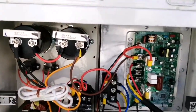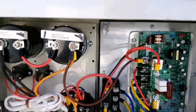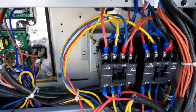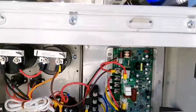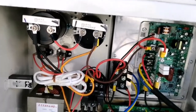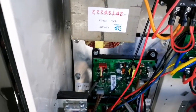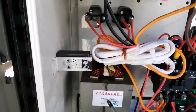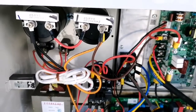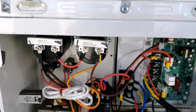On the back side you can see this is the IPM board for the inverter compressor. As I told you there are two fixed compressors, and for those we have two magnetic contactors — one on the right and one on the left. Here we also have one inverter compressor, and to run it there is an IPM board. You can see this is the electrical filter board, and this is the left fan module. There is one reactor here, and we have two capacitors. These are all the electrical parts.